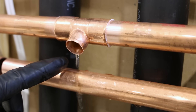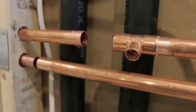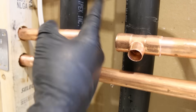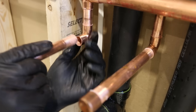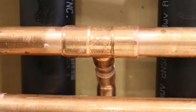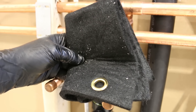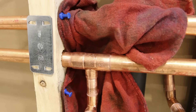If my pipes still have some water left in them, a great trick to stop the dripping is to get a piece of white bread, roll it into a ball, and stuff it down the pipe as far as you can. It'll temporarily stop the flow while you solder and dissolve once you turn the water back on. Go ahead and assemble everything together making sure the pipe is fully inserted all the way into the fitting, and wipe any excess flux off with a rag. Since the joint is pretty close to the wooden stud, use a flame protector — place it around the pipe so anything flammable is protected. If you don't have one, a wet rag works just as well, as long as it's wet it can't catch on fire.